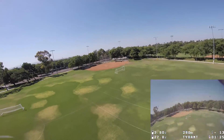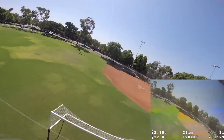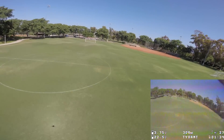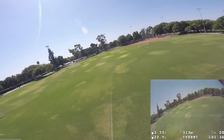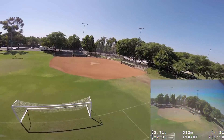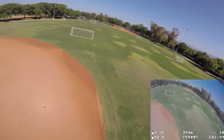This is kind of what I was expecting: 351 on default with I-term relax turned on and the feed forward feature usually flies pretty good on a lot of 5-inch setups. This is the 6S setup specifically.